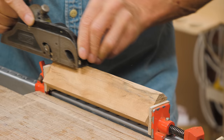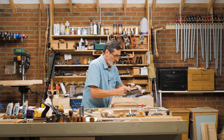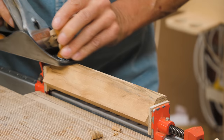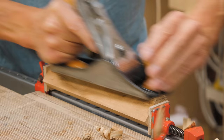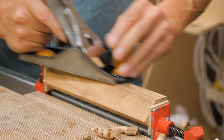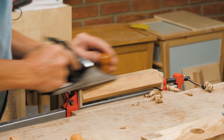This hogs off quite a lot of wood — 'hogging off' is a technical term. I'm going with another converted scrub here — a shallower one. Having said that, you can do the whole lot with a handsaw: rip it down close to your line and then go with a number four. It's not going to be much different time-wise. I'm staying parallel to the surface and working near to my line.